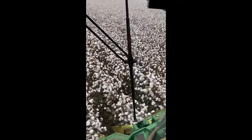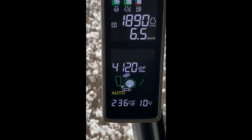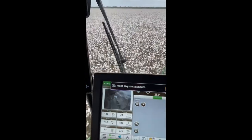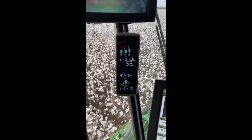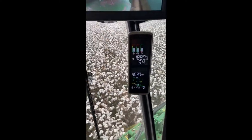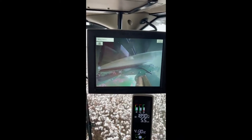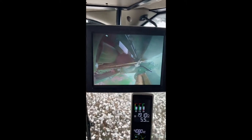This footage is from early in the season when we were still sorting all these issues out, probably 10 days in. Once we got the machines optimized, we would have been traveling at probably 7.2 kilometres an hour instead of 6.4, and maybe slowing to 6.6 or 6.8 for the wrap and eject cycle. These little things really can add up to a big difference.